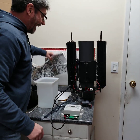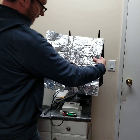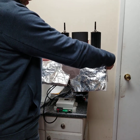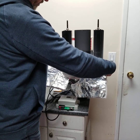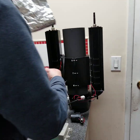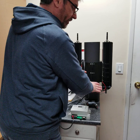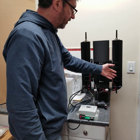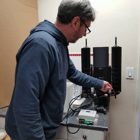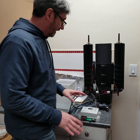It comes with a mat. We recommend you use the mat — it goes on the back of your stove, straddles the back and around the six inch pipe, and it protects the pipe and all these components from overheating. They are all high temperature rated at 550 degrees direct heat, but as you can see this is all elevated above the stove so you'll never get that heat.